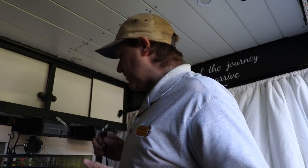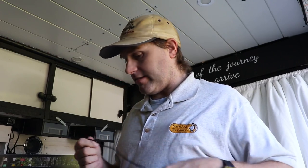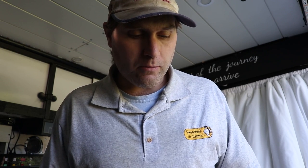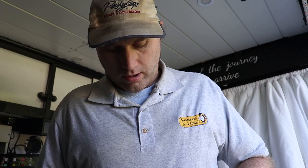In the meantime, I'm going to show you how, using a few spare parts and components I have laying around in the van, we're hopefully going to figure out what the major problem is. I'm going to plug this into my AC power on the wall and show you the issue. I'll take my voltmeter and plug it in to show the type of power we're pushing out. Right now we're outputting — it's bouncing between about six and eight volts — but it should be holding about eight volts steady.